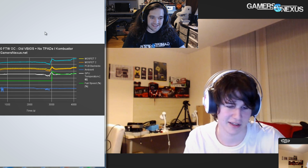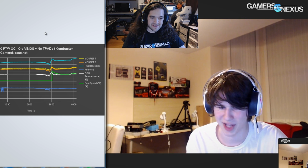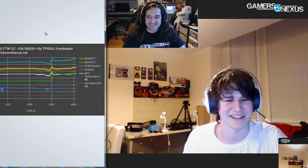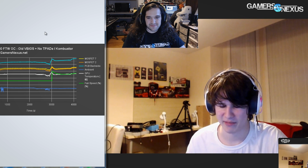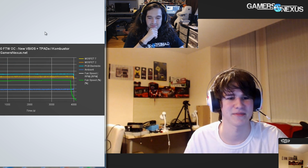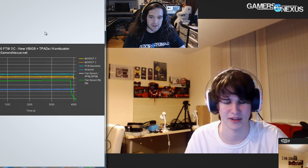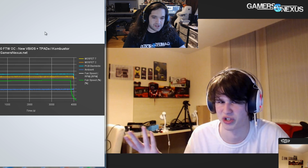So I'm almost certain that EVGA just has a bad batch of capacitors on some of the cards. Hopefully not all of them, that would be a disaster. I think they probably just have a bad batch of capacitors and they're just going up in flames. Now it's really up to EVGA to state that that's the case, confirm it or disprove it, because they obviously don't have a thermal issue with the MOSFETs because we tortured them.